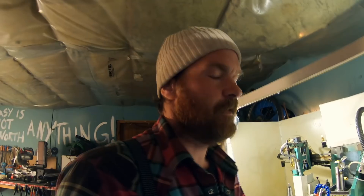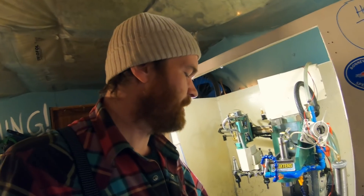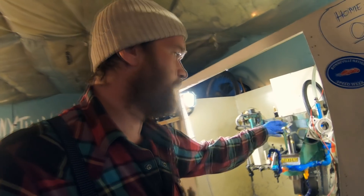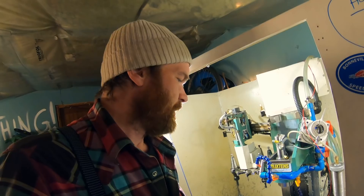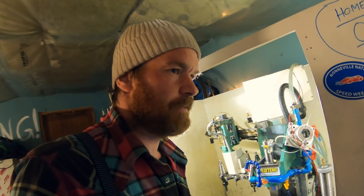That's two nights and half of this day worth of troubleshooting, and it turns out it's the PWM frequency that was too low. This erratic behavior of the motor had me pulling everything apart. The spindle — I re-greased the bearings, which is good and I'm glad I did because they were kind of dry, but all this troubleshooting and it turns out it's just the PWM signal.